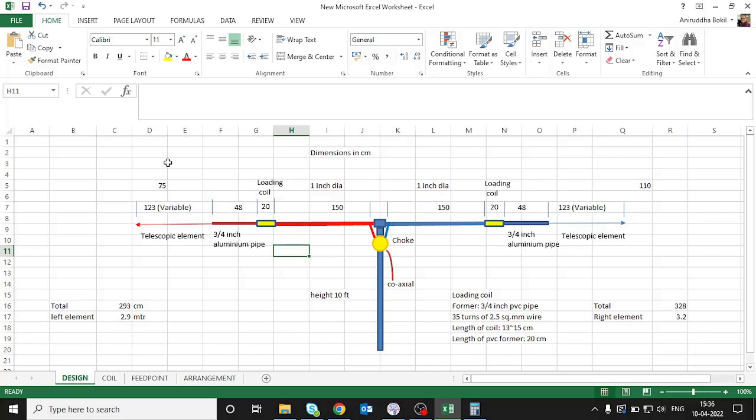When I built the antenna I found I needed about 75 centimeters on one end and 110 centimeters on the other, but don't concentrate on these values — you may get different ones. With the available 123 centimeters of telescopic element you can adjust to find the resonant point and a good SWR. There is also a common mode current choke: one cable attaches to one element and the other to the second element, connecting at the screws that fasten the center PVC-T to the aluminum sections. Then this connects to your coaxial cable.